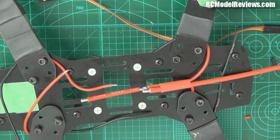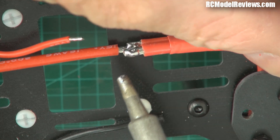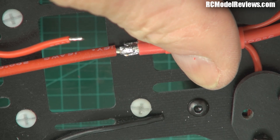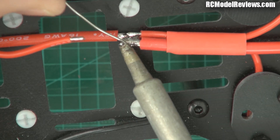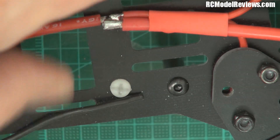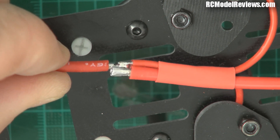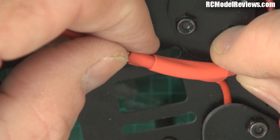The key here is we've got to try and heat this up without the whole rest falling apart. I'll turn this around because that's going to put that in exactly the right place, and I'll use the frame as a support. I'm heating this up and it should start to flow. I'll add some more solder because lots of solder is the key - the more solder you add, the fresher the flux, making it more likely to flow readily. It has flowed - not my best piece of work by far, but it has flowed. So now we've got a red wire on and those two red wires are joined.